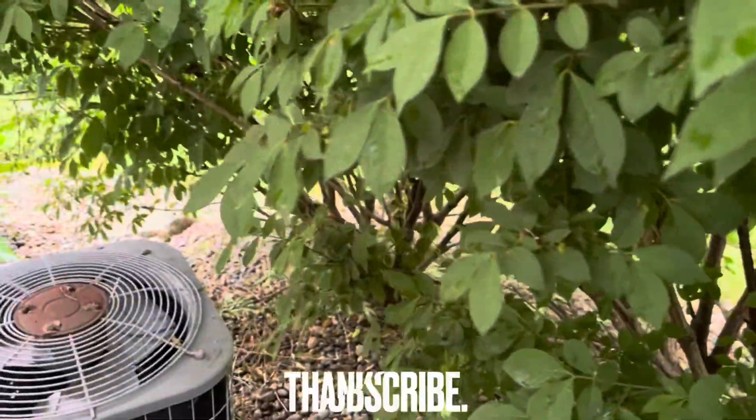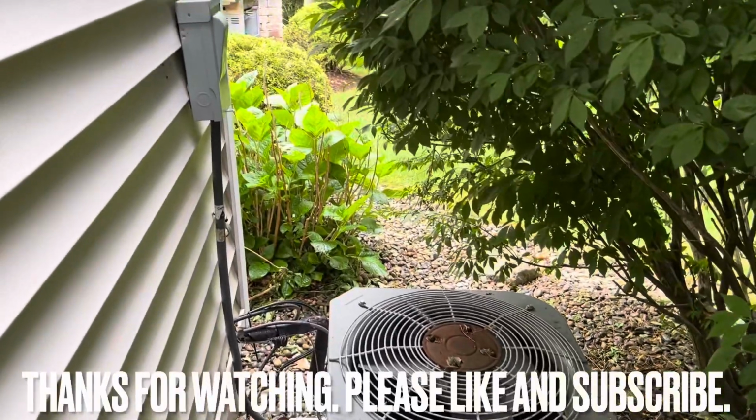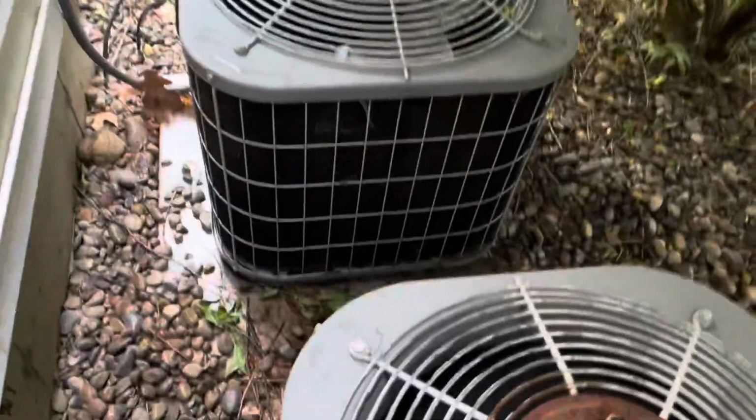I'm gonna wrap it up. I got my subcool back to 14 degrees. Pressures are good. This guy's running well.